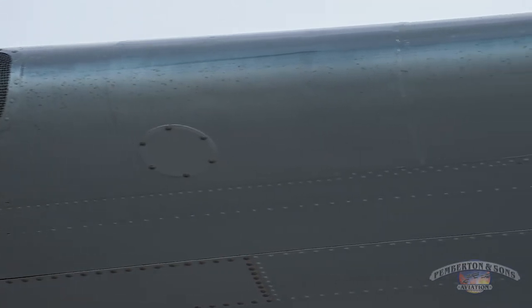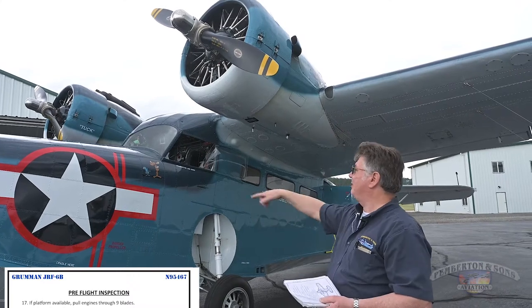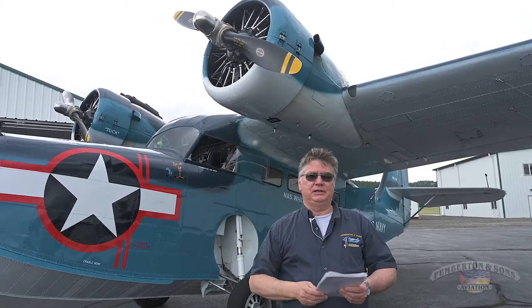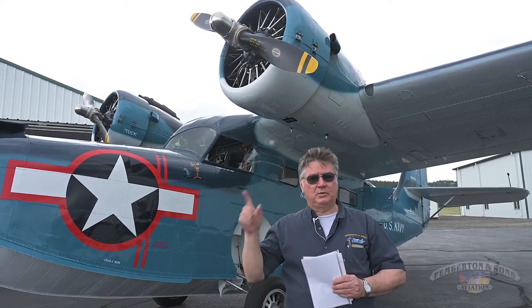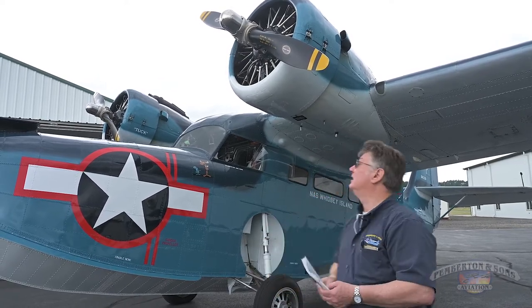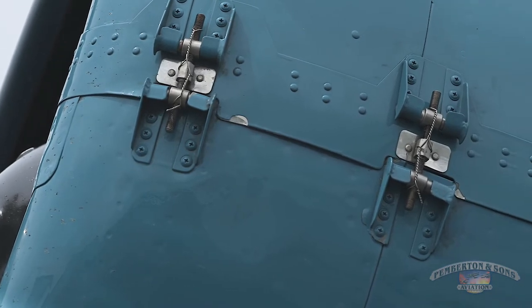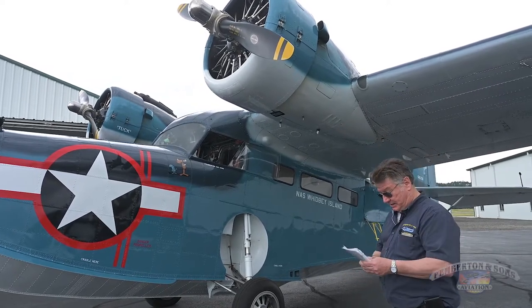I can also look along the leading edge of the wing for dents, loose inspection panels, and that my landing light lens is intact. Prior to this presentation, we bring a table up and rotate the propellers — typically nine blades or four and a half revolutions — to mechanically clear the engines. If we've flown the airplane within a day or two, we'll typically motor with the starter and rely on the starter clutch to slip in case of a hydraulic lock. But if it's sat more than a few days, we manually pull each engine through. I'm also looking for leaks and making sure all the cowl hardware is safety-wired and tight.